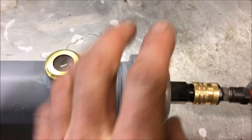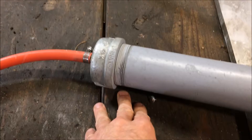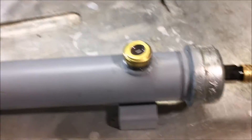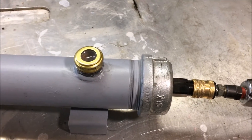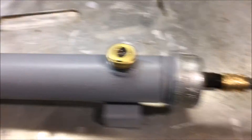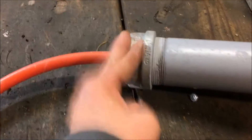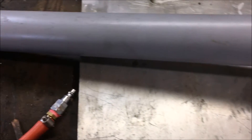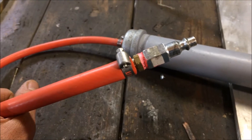You do have to put some kind of padding or separator inside to separate the beads from the airlines. I have a screen system — it's kind of my own little design — you can work with whatever you want to use. You don't want something that's going to ice up, so you've got to be careful with your design. If you have a bunch of screen in there and it just ices up right before it even gets into the unit, you're going to be in trouble.